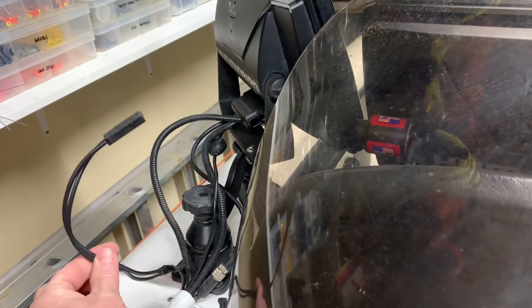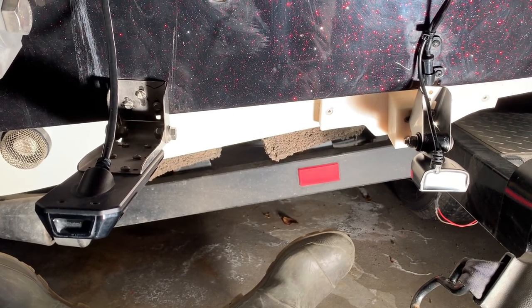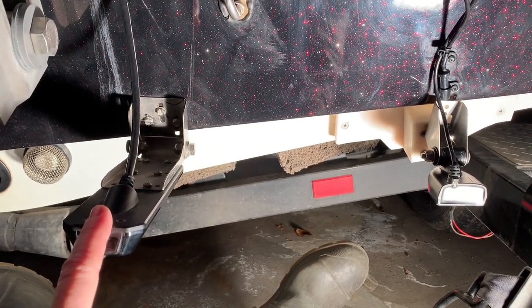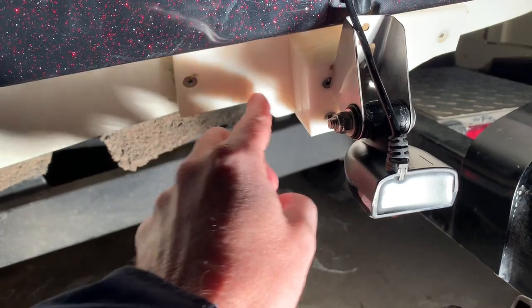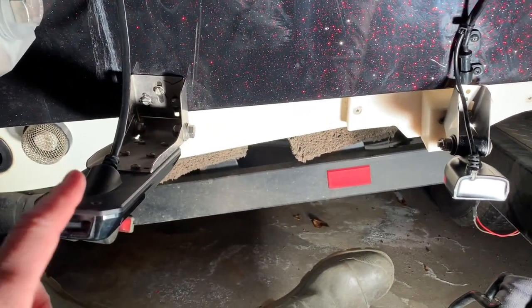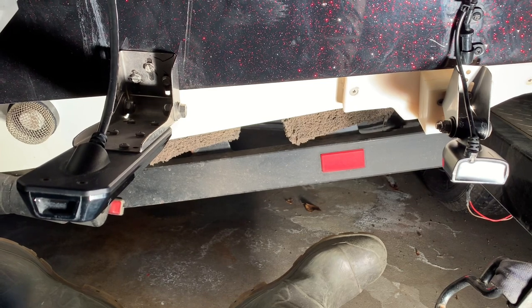You can see the puck connection that can be put into the bus if needed. At the back of the boat I'm showing my transducer setup. I have a bass boat, so I use a high-speed transducer along with my side imaging transducer. The high-speed transducer line that goes up through the middle should be aligned with the hull in an area with little turbulence. These two transducers can be connected with a Y cable, which I'll go into more detail on later, and they will go into my side imaging unit at the console.